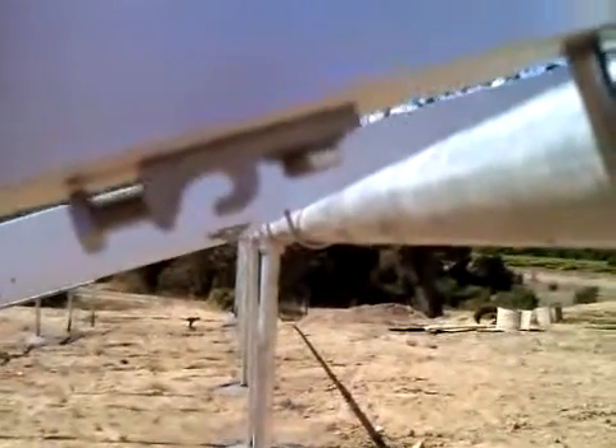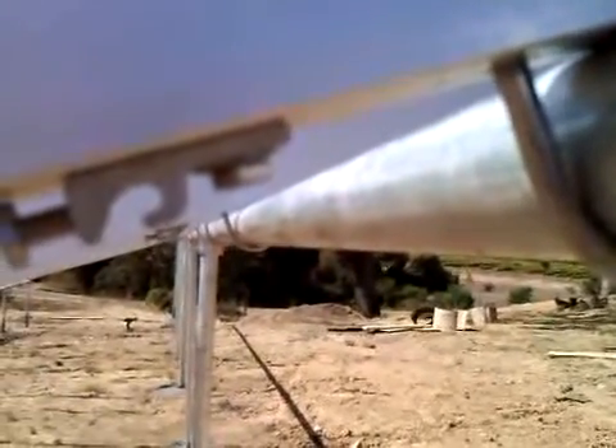Wanted to pass a little time-saving tip on to you. You'll notice that the ground mount lugs are bolted to the bottom of the railings. I did not punch the holes through when I was drilling the holes for the U-bolt. I had all the rails off of the racking system, all on sawhorses, and I did not cut the grounding lug holes. So what happened was I ended up getting on my back, underneath the rails, having to cut them after they were mounted, which is a big pain in the butt.